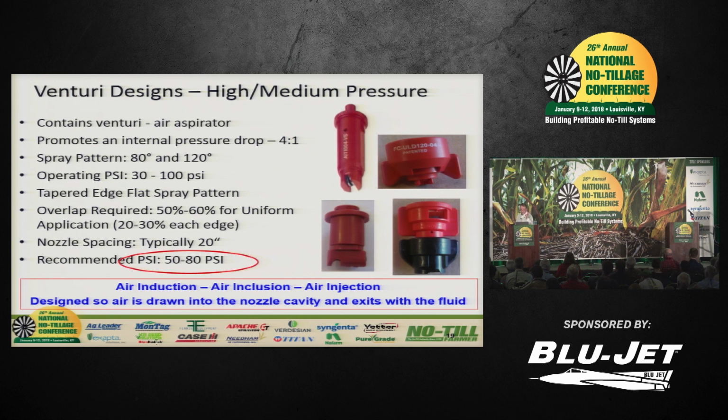Air induction, air inclusion, air injection. They're all nozzles that are designed to include air in the spray process without the function of a pump. So it's a naturally occurring process. These tips have aspirators. They have an internal pressure drop of 4 to 1. That's how the droplets get bigger and the drift gets less. Fan angles similar. Operating pressures are typically higher.